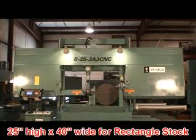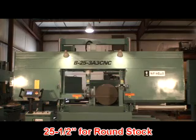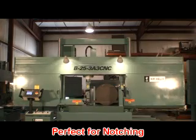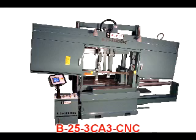Cutting capacity is 25 inches high by 40 inches wide for rectangular stock and 25.5 inches for round stock. And because the B25-3A3CNC is a twin post design, it can also be used for notching. WF Wells also offers the B25-3CA3CNC, which has a 6-degree canted head.